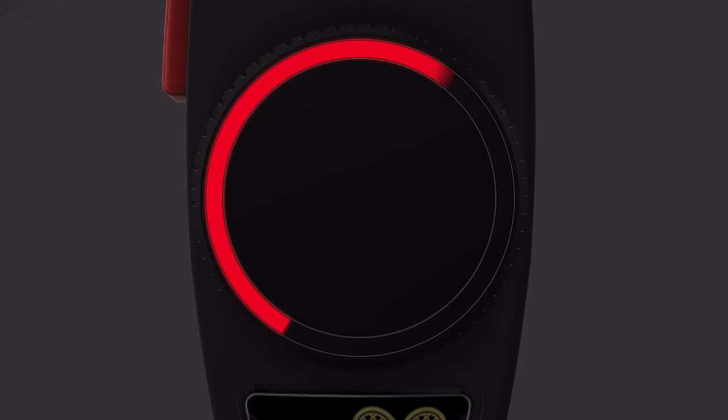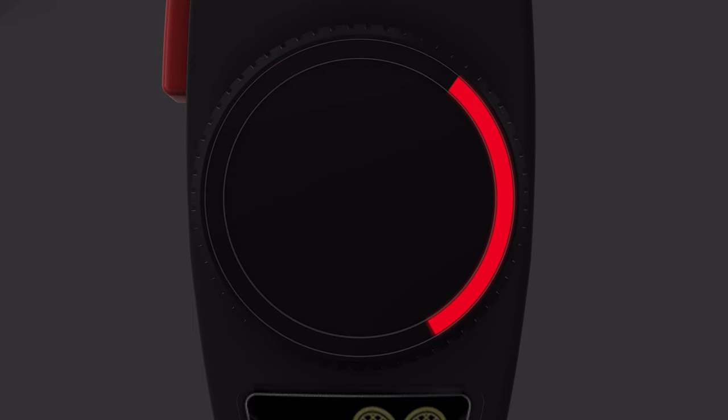While the dial can rotate about 330 degrees, the actual usable arc is closer to around 90 to 100 degrees on a controller using a standard 1 megaohm potentiometer. Typically, this arc is closer to the stop point of the dial's rotation. Let's take some measurements and determine what our usable arc might be. This rectangle will represent the total 330 degrees the dial is free to rotate. Keep in mind, the paddle starts with the maximum resistance and lowers the resistance as it's rotated clockwise. This means the scan line goes from the max number of scan lines to the least.